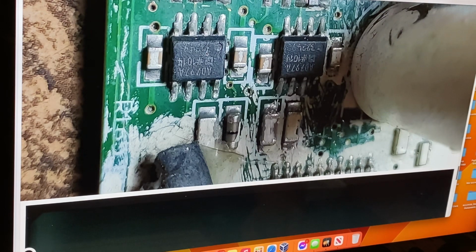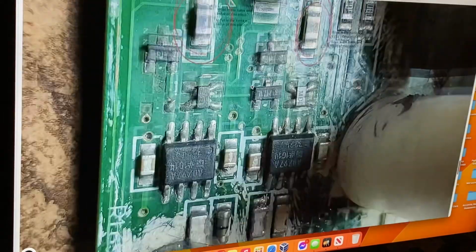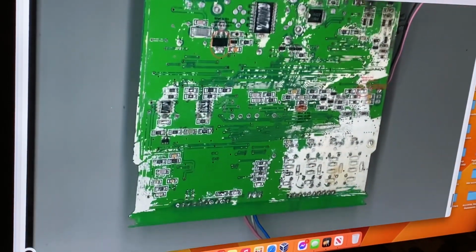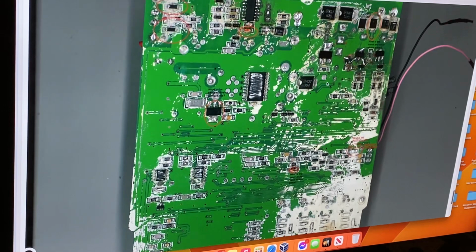If they pull too much current, it'll turn the detector off. It'll shut down. The other thing too, what you should look at, and a lot of people don't realise this, is that the negative 5 volts, the clean rails, they actually run clean filtered rails to the input stage, which is very good practice to do. You don't want dirty stuff going into your low noise receiver.